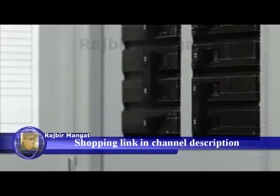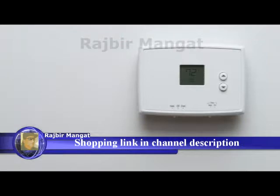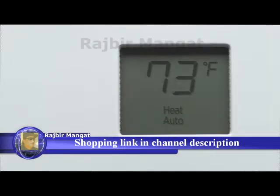Let's get started. Go to your home's breaker box and turn off the switch that controls power to your heating and cooling system. This will protect it during installation. You can also turn off the main power switch at the breaker box. Make sure you've turned the right breaker off by changing the temperature with your current thermostat, and wait a few minutes to make sure your system doesn't turn on.